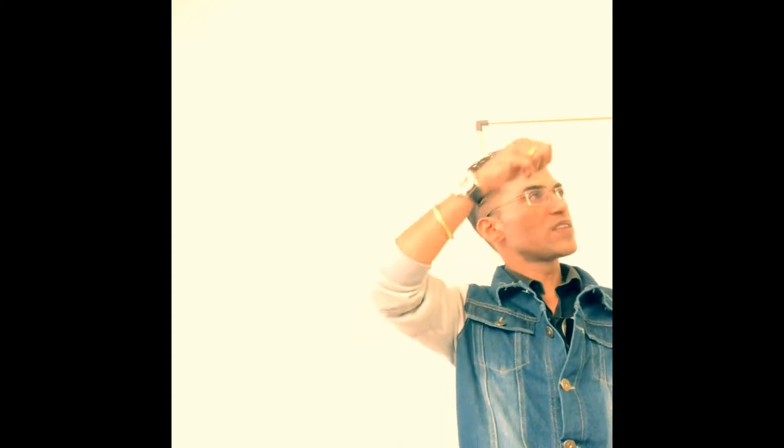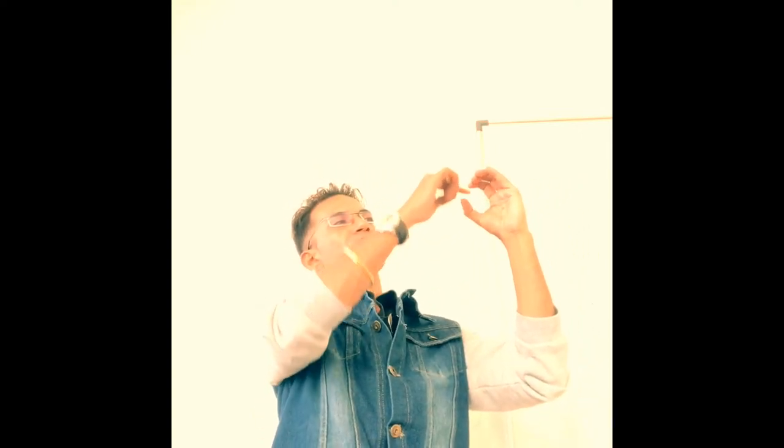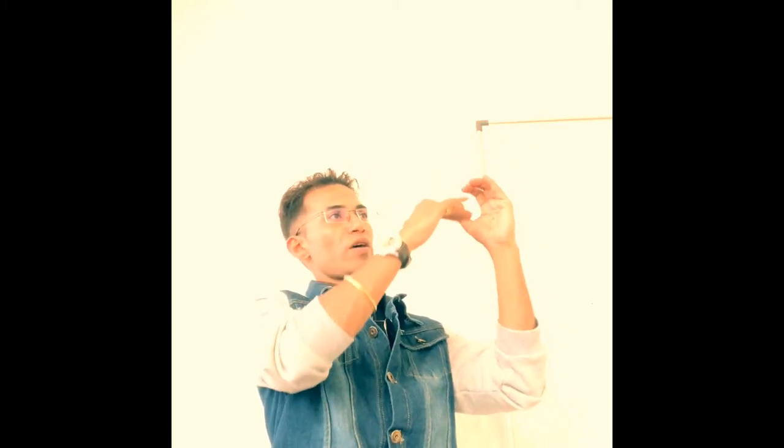Now if you need to draw a center line along the length of the cylinder block, if you use your hand, quite naturally it is not possible, isn't it? Can you use a normal ruler also? Cannot use, right? So we require some sort of a device which remains stationary irrespective of anything. How can this scriber be made stationary? Also, let's say I need to mark the bar somewhere lower, sometimes higher, maybe sometimes much higher. That means we require a condition where we can change the position of the scriber as well. We want the scriber to hold steady, and at the same time we should be able to change the height of the scriber.